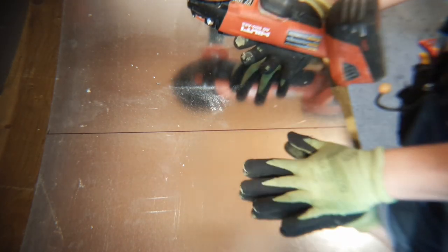First things first, make sure you have your material secure — it's not going to bend over and you're not going to need a hand while cutting it. Before you start to cut, start the wheel away from the material. Don't start on the material, start away. Wait for it to get up to speed. Make sure you have a good handle on it. You want to push with the grinder, not pull. Once you get in a groove, you'll feel it — just follow it.